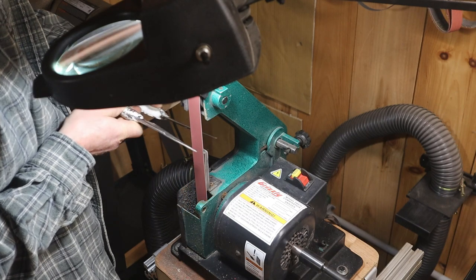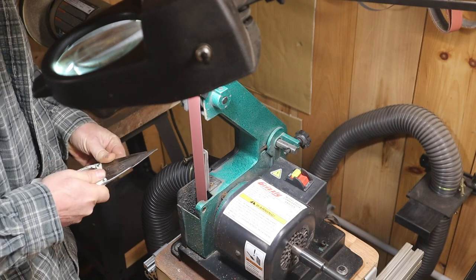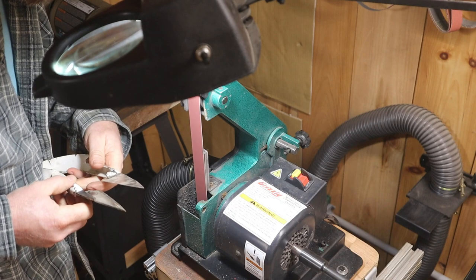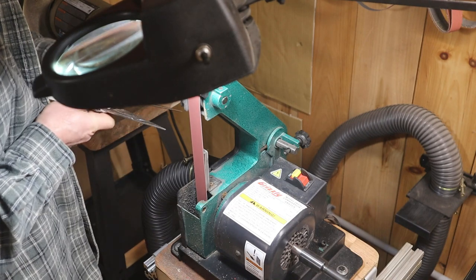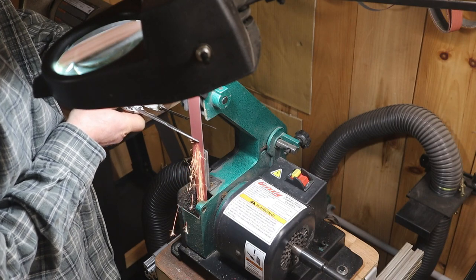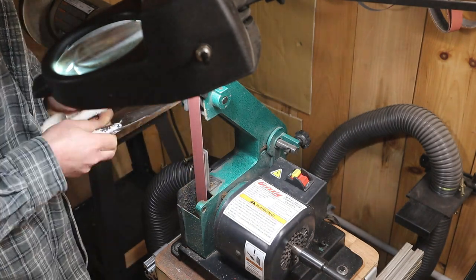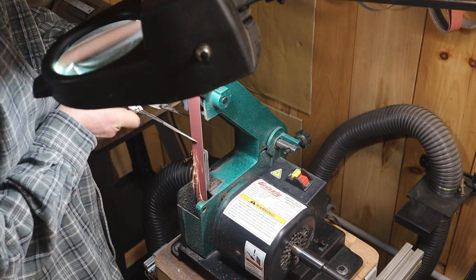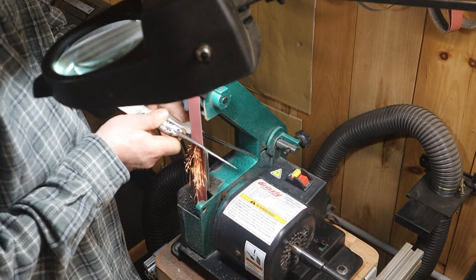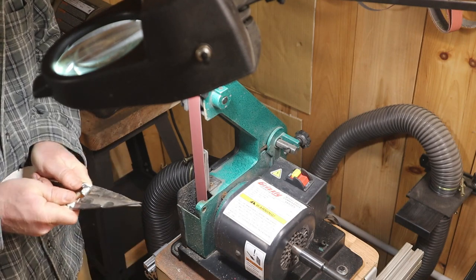The back has to be flat — these are going to need to be ground back quite a bit, but we'll find out more about that later. I'm spreading them apart to close, and pushing them together to open, which pushes the burr from the flat side back to the bevel. I look at it under bright light to see the burr along the bevel; if I don't see it, I do more grinding. I'm charging around $10 to $12 for these, which can match the dollar-per-minute goal I've set for my shop.